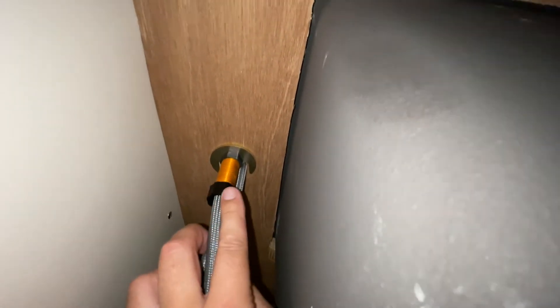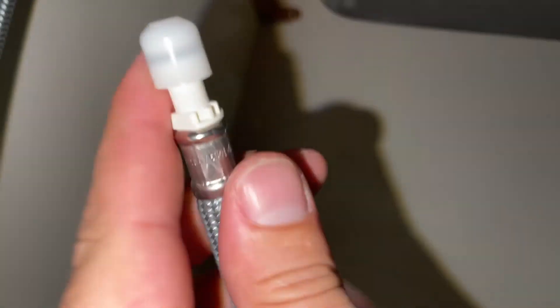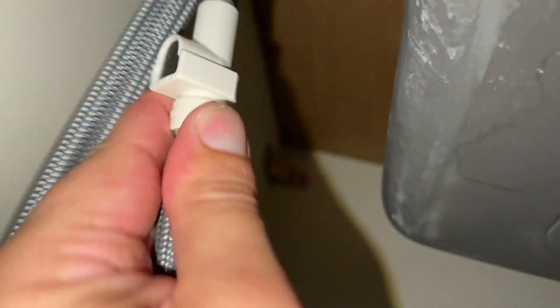This plastic one is just a guide to keep this hose from snagging — that's all it does. So you don't crank it on all the way tight. Now when you're ready to put the pull-down hose — these are the supplies. This one is the one that goes to the faucet. It just attaches into this. To do that, you pull off the protective tip, set that aside, and you just press it in and you hear that click. That's it. Give it a little tug and that's sealed.